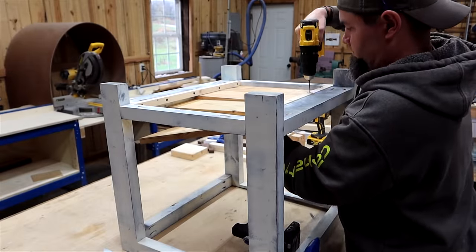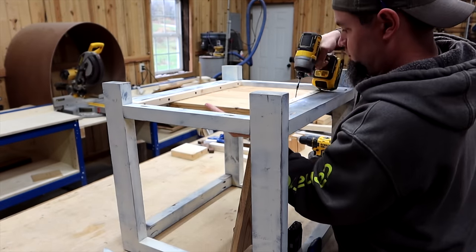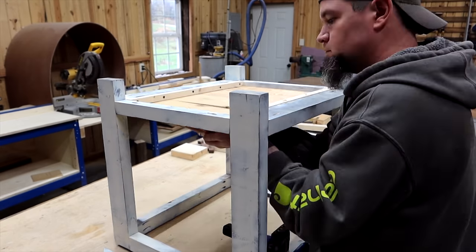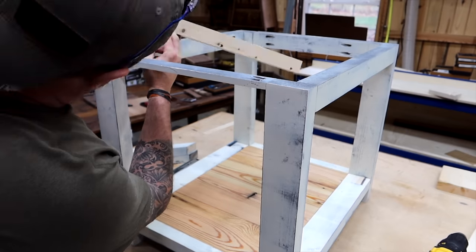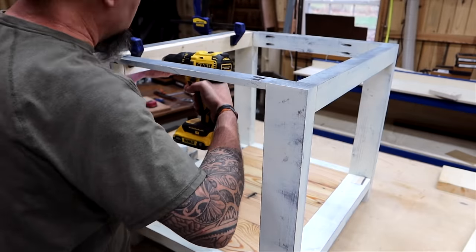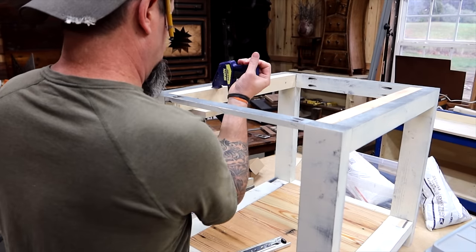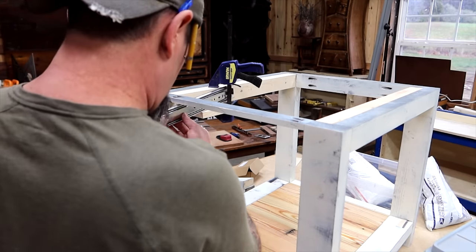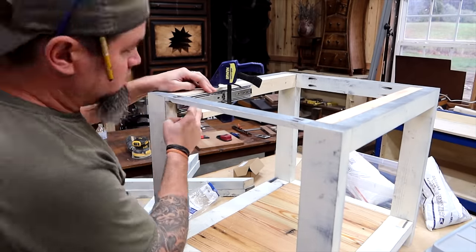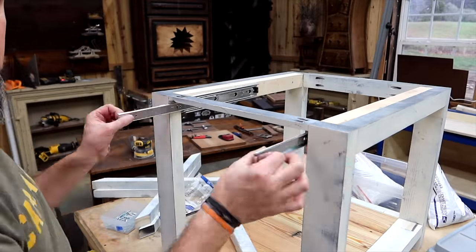While that's drying, let's go ahead and install our floor from the bottom. Now to install slide mounts K — I've just pre-drilled holes straight up so that whenever we go to install our top, we can screw straight into the top from underneath. These mounts will sit flush with the top and be installed on both sides. Now we can go ahead and attach our slides. I'm using 12-inch slides and I'll link all the hardware I use for this build in the description. Make sure the slide is even with the front leg and that it clears the top rail.